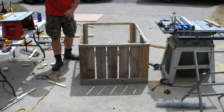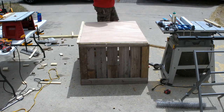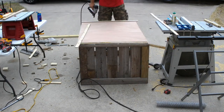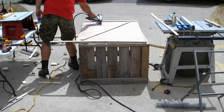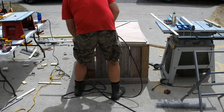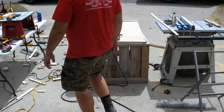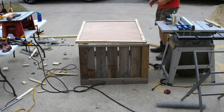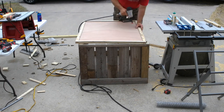It turned out my fence points were just a little too tall, so I cut them flush with the top using my oscillating tool. When I brought the lid over, I noticed not only had I installed the plywood with the label facing out, but the plywood was just a little undersized for the frame and the 1x2s were starting to twist. So I came up with a solution that addressed all three issues in one go: I picked up the three-eighths-inch off cuts from when I resawed the top rails and attached them to the lid like trim pieces on the opposite side of the plywood from the 1x2s, then nailed them down. That allowed me to flip the lid over, putting the label on the inside, covering the undersized plywood edges, and reinforcing the corners where the 1x2s were pulling away.